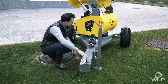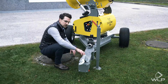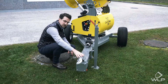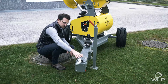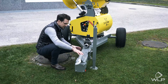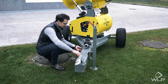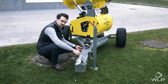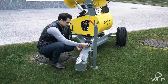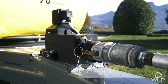This is the trailer version with off-road wheels, but it's also possible to change it into the on-road version by taking this away and mounting a wheel here. The tow hook can be changed depending on the needs of the car or truck that's going to tow the cannon, with a handbrake incorporated here. Within the frame, in this latest compact version of the WLP systems, we have an integrated submersible pump which runs on 2.2 kilowatts. The water flow goes in through here, and within this box we have an electrical valve and a filter.